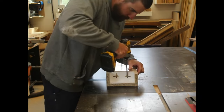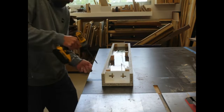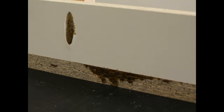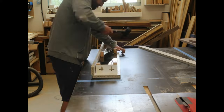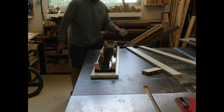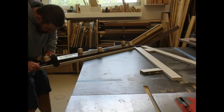About two days later, I took it to the shop to de-mold and, pulling out the screws, I started to get pretty nervous as I noticed three leaks — but it came out of the form with no problem. I think the porosity of the particle board within the melamine actually helped to soak up the leaks and not let them drip off onto the floor. Win.